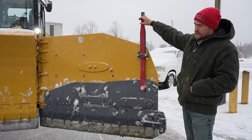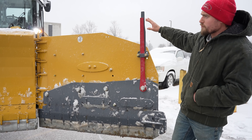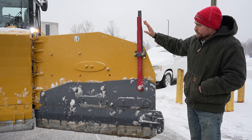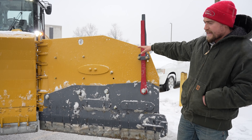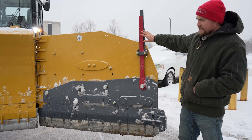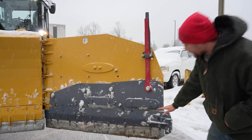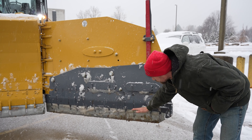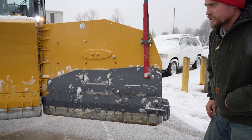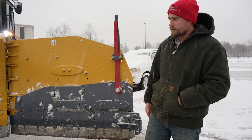In the original live edge max pro that has non-full live edge on the wings, these sticks are a lot more beneficial than on the full live edge, because there's so much more forgiveness up and down and lateral in your wings and on your cutting edge. So these are not as heavily used, but they're also a great indicator of where the wings are on the plow.